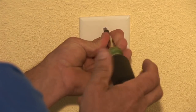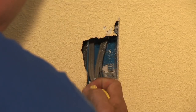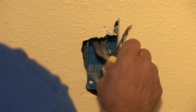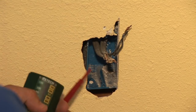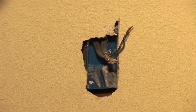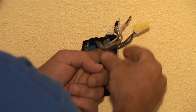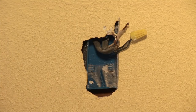Let's get started. Pull off this cover — we have a couple of wires in there. Always make sure after you turn the circuit breaker off that you check for power with your voltage tester. Go from bare to each wire and from the white to the other wire. Once you assure yourself there's no power, move the wires out of the way so that you don't drill them with your drill. Use a long drill bit to drill through the exterior of the house.